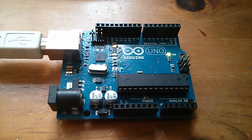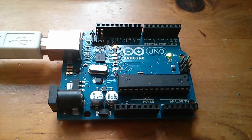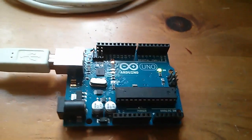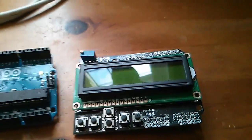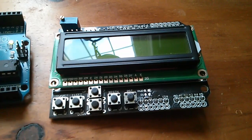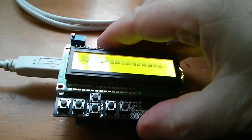If you're playing around with the Arduino, you'll probably at some stage want a display to show measured parameters and so on. What you might do is choose one of these 16 by 2 LCDs. This one is on a shield and has a few push buttons wired up to the analog A0 input — you can measure the different voltages they produce. I'm going to shove that display onto the Arduino.